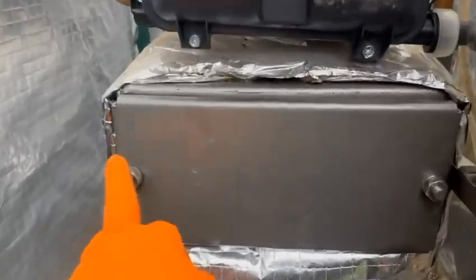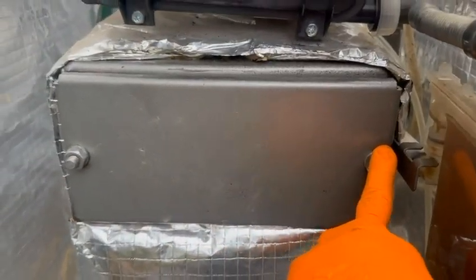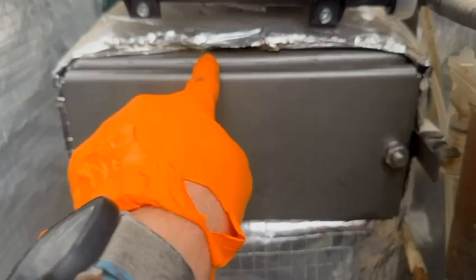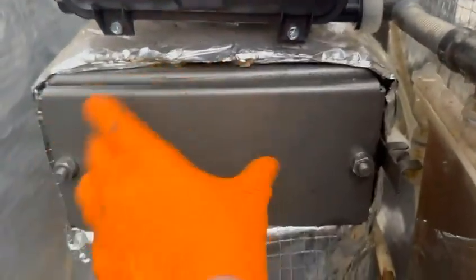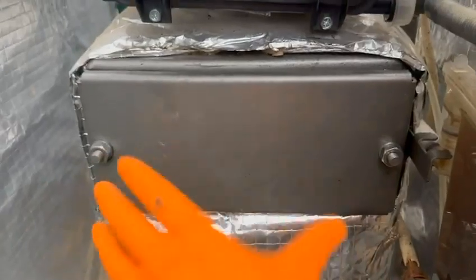Okay, so we're now going to move on to the trap next. Just going to drop back a step. Obviously, I've done the 17s up now as well. Don't over tighten them because you bend it here, and then you get combustion gases leak out of here. I've seen no end that are dirty here because these have been over tightened, and it basically just bends.